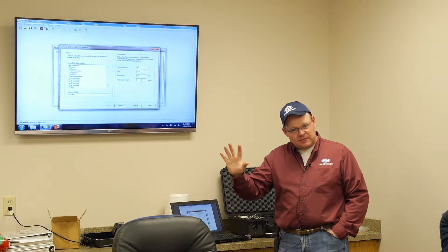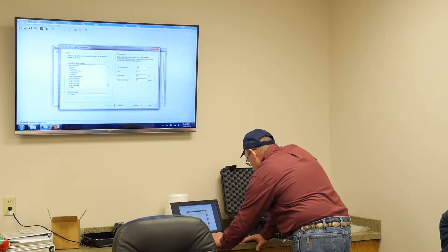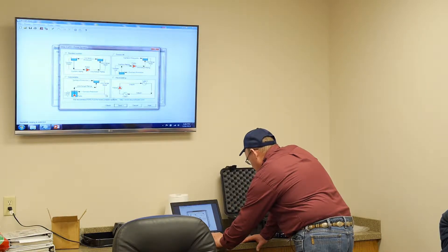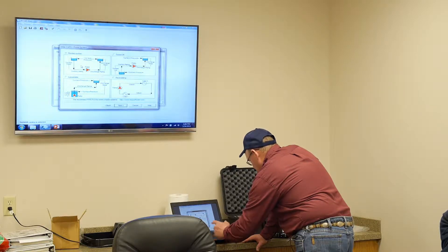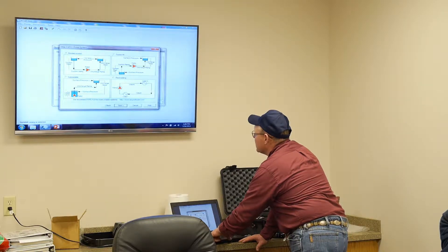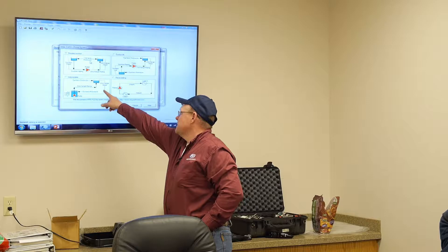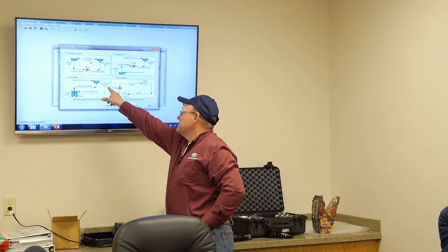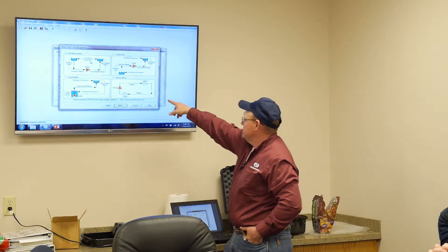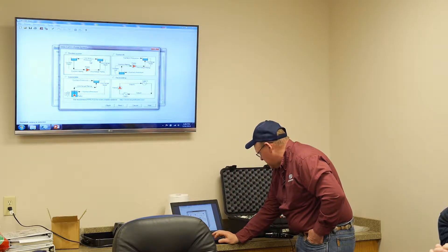Just know what viscosity is, don't get hung up on it. We're going to put vapor pressure in. We have a system like this: we have a suction head, we're pumping out of one tank to another tank — basically no suction lift. This would be a closed-loop system. We're working off pumping from one tank to the other.